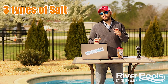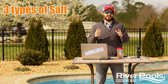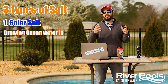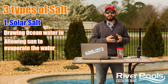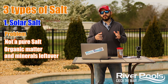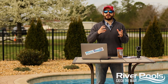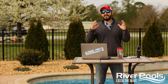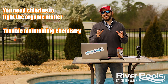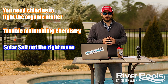There are three types of salt you can consider for your salt water pool. The first would be solar salt, achieved by drawing ocean water in and then allowing the sun to evaporate the water, leaving the salt behind. The problem is that this is not a pure salt — what's left over is a lot of organic matter and minerals. If that's introduced into your pool, the salt water generator creates chlorine, but you've got to have a lot more chlorine to fight and kill all that organic matter, and you're going to have trouble maintaining your pool chemistry. So solar salt is not necessarily a good idea.